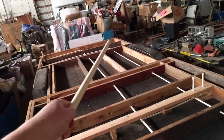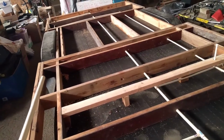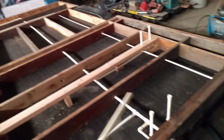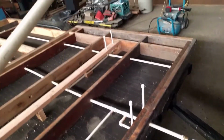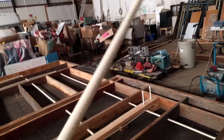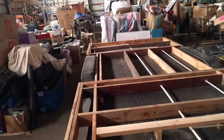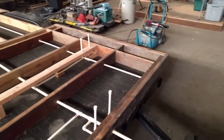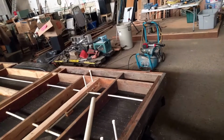And so there's 3 circuits, and the bathroom here is going to have a circuit. On the bathroom wall, in each corner on the outside toward the sleeping area, there is going to be a receptacle facing both directions. There'll be a receptacle here at the sink level, and there will be a light here over the sink and the mirror. Right above the toilet there will be a light up here on the ceiling with a fan and light assembly, bathroom fan, you know. And this is where the shower is going to end up being, and I think I'm going to put some type of little can light into the ceiling there.